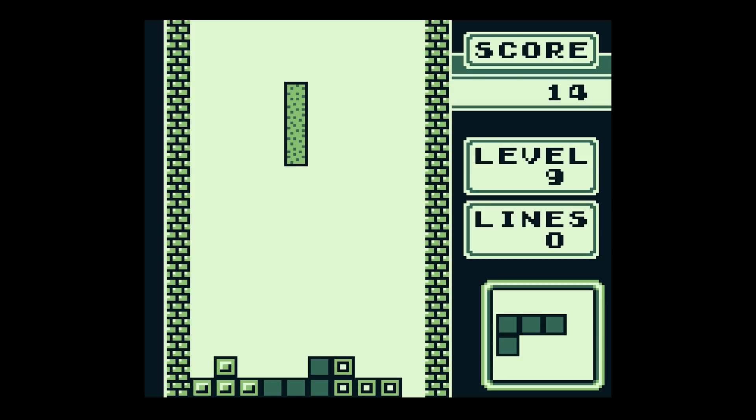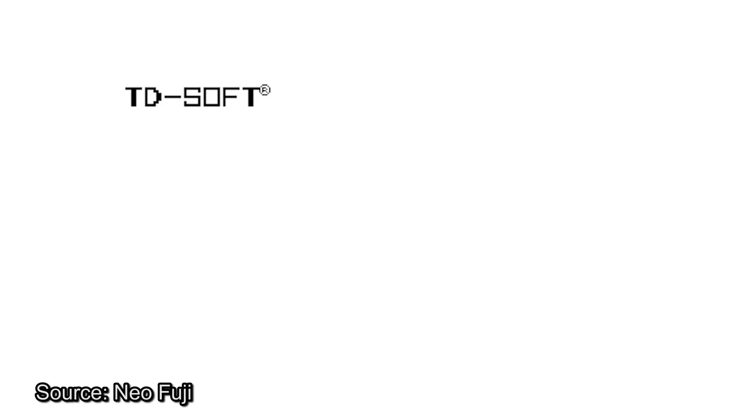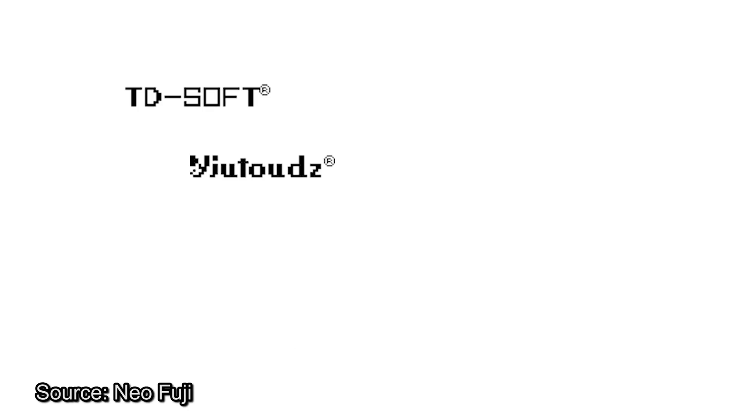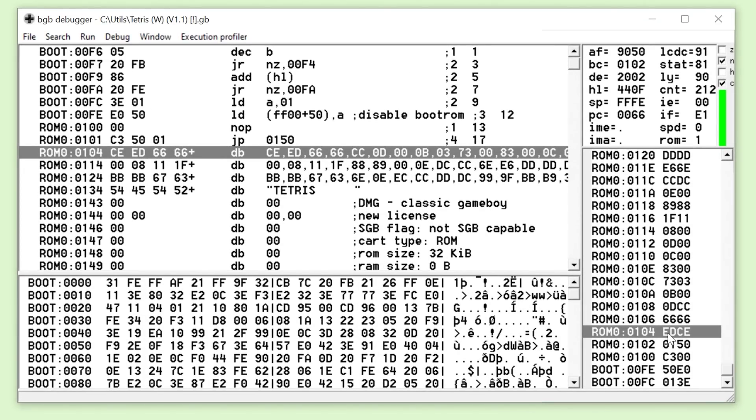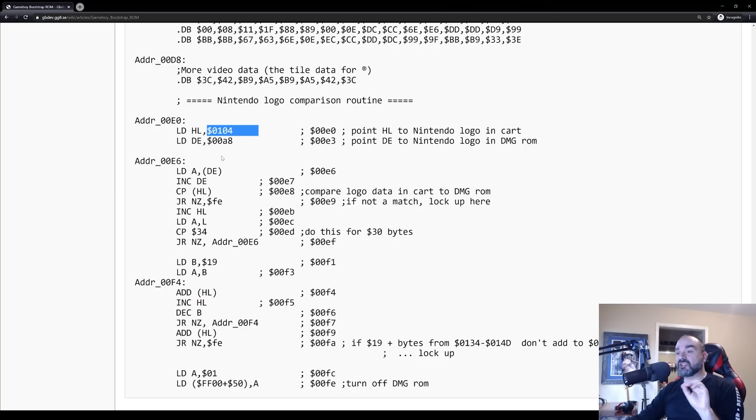Still, Nintendo's logo check made some companies come up with a way around the trademark. They would do this by altering the Nintendo logo with their own, circumventing the issue and any possible lawsuit. But how was this possible when we said that changing one byte of the logo would cause the Game Boy to freeze? The Game Boy logo is read twice — the first time to display it and the second to validate. The custom logo is read in for the first read and displayed, and then the Nintendo logo is quickly swapped back in before the validation occurs. This fools the boot ROM into believing nothing was tampered with. This process, however, won't work purely in code — it requires precision timing to make sure the Nintendo logo is applied at the correct time, and this is done with the help of some hardware.